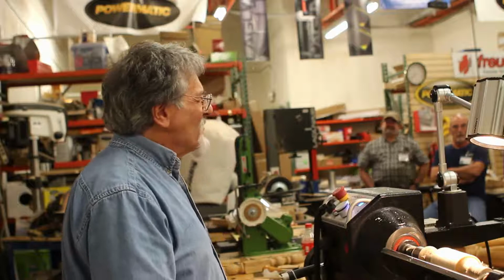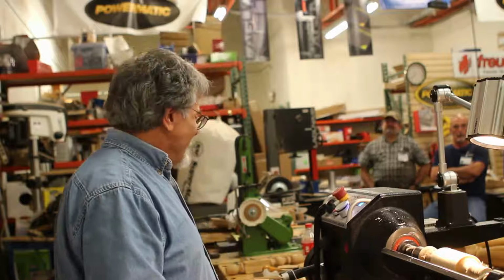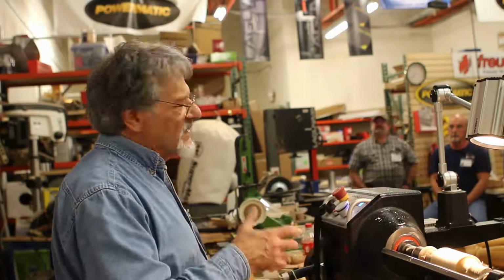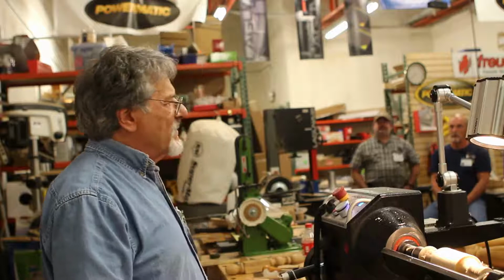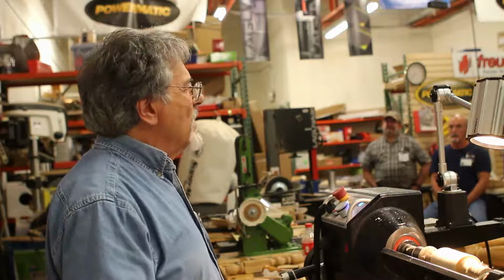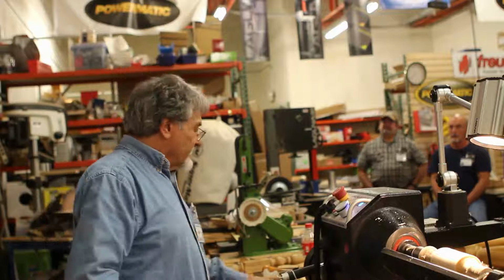Big deal. Another thing is that the claims that are made for this sophisticated steel are usually exaggerated. They say it lasts 10 times longer or 7 times longer. High-speed steel does not last 5 or 7 times longer than carbon tool steel. It's maybe 2 times at the most. I think it's not even 2 times, compared to, say, a Buck Brothers chisel that was made 120 years ago, like this. So before I talk about chisel steel,